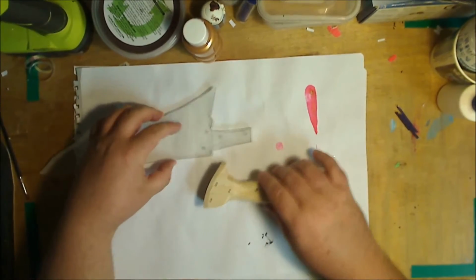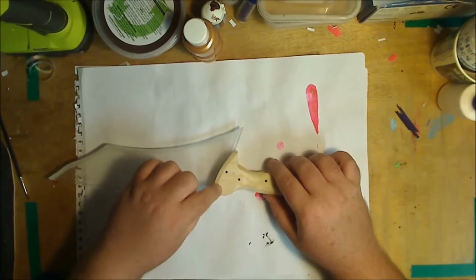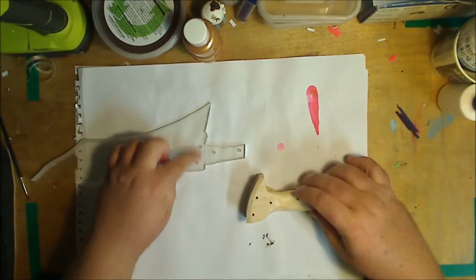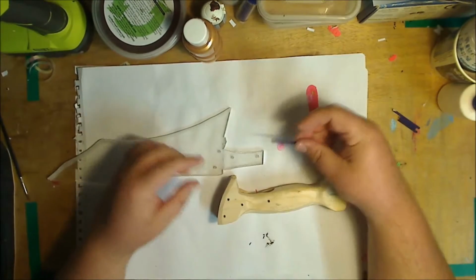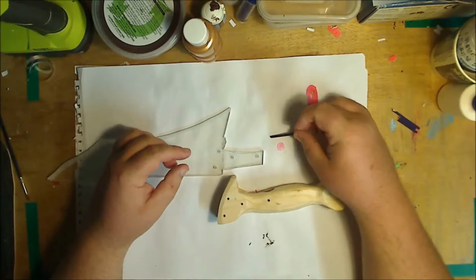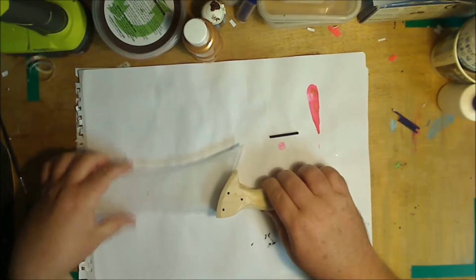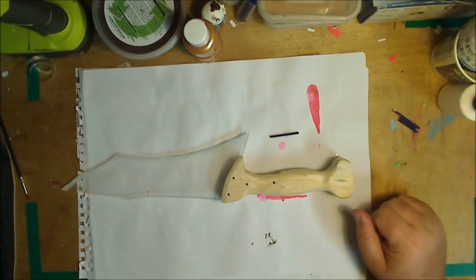And what I've done as well is, once I had the actual slot cut for the blade to go in, I've drilled these 4 holes. They go all the way through both sides of the handle, as well as through the blade. That's just so I can use these little pins here, which are just a 1.5mm timber rod I had lying around, to poke through, just to stop the blade wobbling around and wiggling and causing any sort of concerns and problems once it's in.